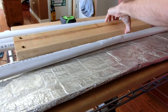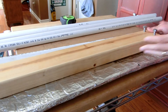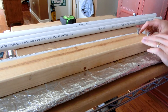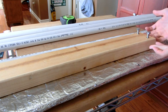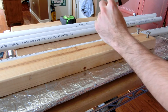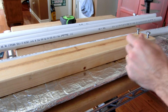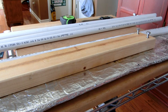I'm doing that using my precision tapering jig. You may or may not have seen this because I did it quite a long time ago, but it is pretty cool. The whole point being I have these adjustable screws, so I can set the depth that I'm tapering to. I set the depth and measure it with this caliper — I have an internal measure here.